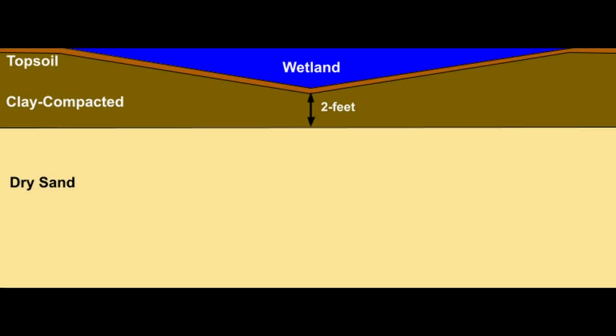A design was prepared for restoring Blue Lake that focused on controlling the leaks in the 2 ponds. The ponds would be reshaped and combined to appear more like a natural wetland, with a maximum water depth of 5 feet. It was not necessary or possible to construct a groundwater dam to prevent water from leaving Blue Lake. This is because Blue Lake is in a basin with sand underlaying the clay.